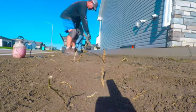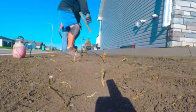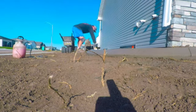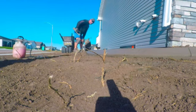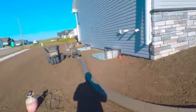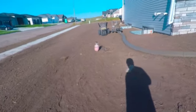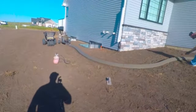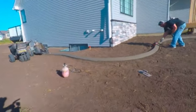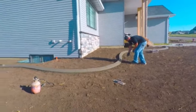You can see right here this is a little flat — take the trowel and just smooth it out, round that off a little bit. You can really tell by the way that moves that the mix is nice and soft. This is a mason sand we're using with the correct chemicals. It comes out of the machine standing up — it's perfect, nice and soft. I can tell right now we're going to need a drain right here and up there for the downspout and direct rain.